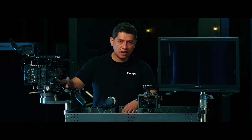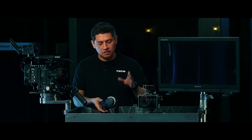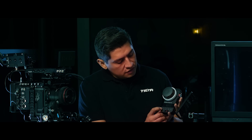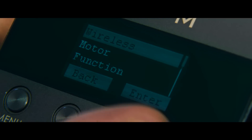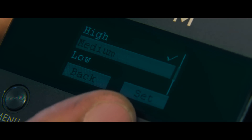The first thing you want to make sure is that you do not have the motor attached to the gear just yet. We're going to adjust that in a moment. First, I want to show you how to reduce the torque. We do this as a safety precaution to make sure if you have any delicate lenses you don't risk damaging them while calibrating your motor. Go into the menu system, down to motor, go to focus torque, and set that to low.